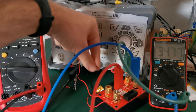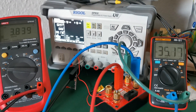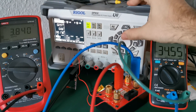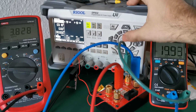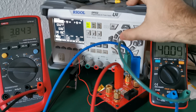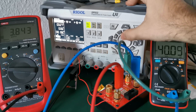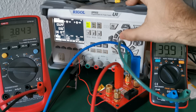The battery is here — it's a really tiny one, 110 milliamp-hour lithium polymer. Let's increase the voltage until we reach the point where it stops. I'm really charging the battery since there is a boost circuit inside the IC, and at some point, if the input voltage is higher than the battery voltage, it will stop.